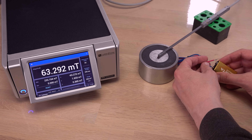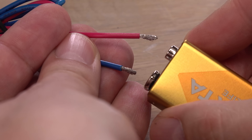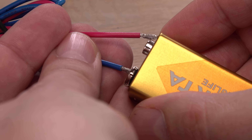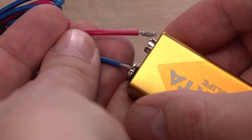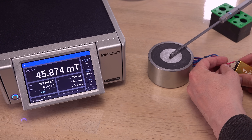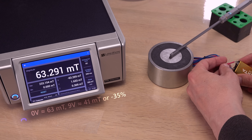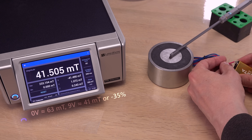Plus to red wire. Interesting — sparks fly when disconnecting, due to back EMF from the collapsing magnetic field inducing electricity in the coil. But more surprisingly, the magnet gets weaker when I power up the electromagnet with plus to the red wire. A reverse electromagnet.